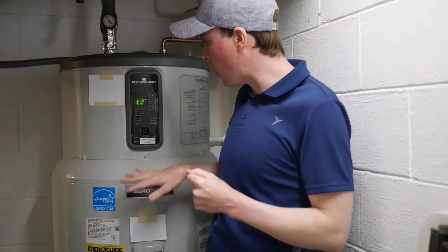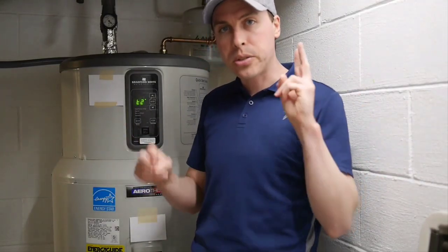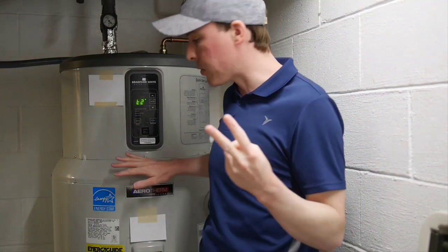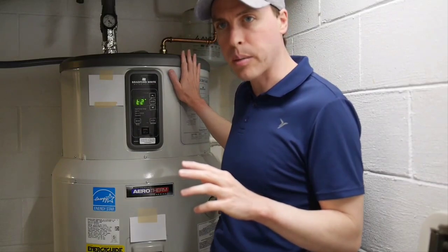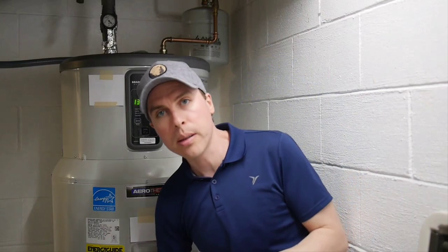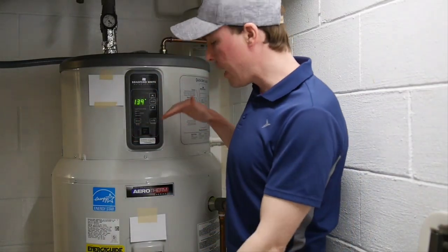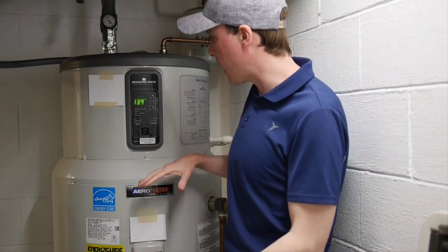This unit is unique in that it appears to only have one temperature sensor. Every other heat pump water heater on the market that I'm aware of has two temperature sensors for the tank specifically — not looking at the compressor or anything like that. There's usually one on the top and either one on the bottom or some way of averaging the entire temperature of the tank.